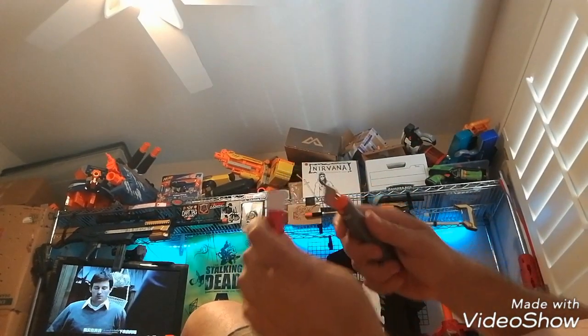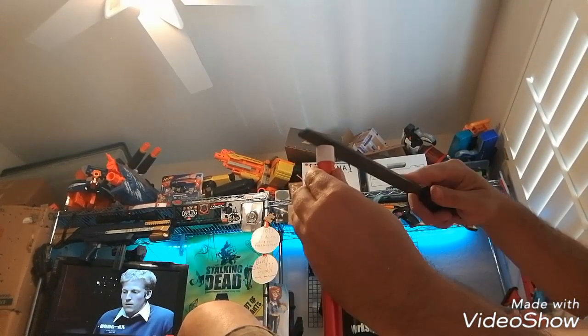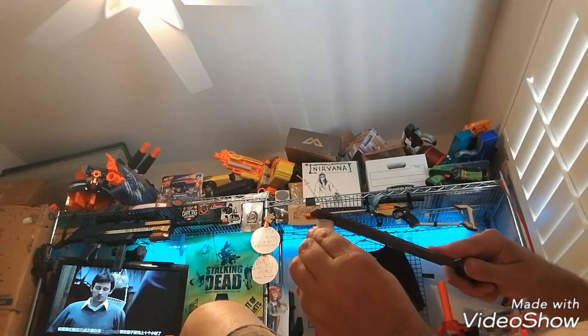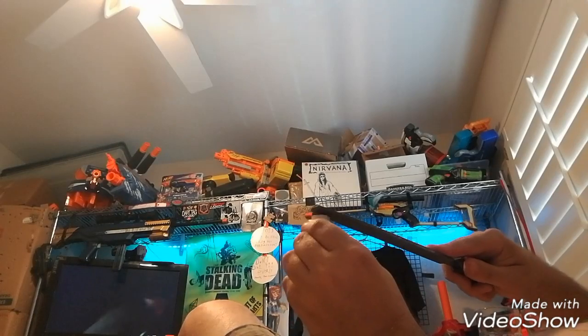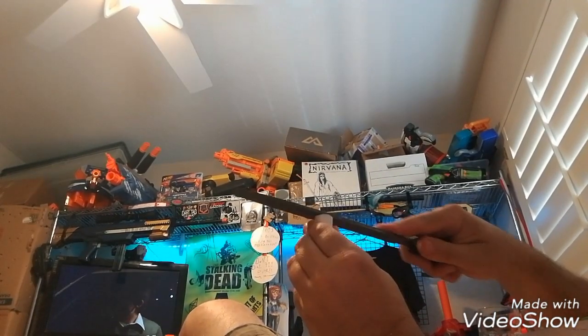Okay, so now I've got it. I filed this down. I'll give it a few more for good measure. What I got is this nice concentric flat level surface. We call this a barrel leveling. We keep the duct tape on there so that if we accidentally hit the sides, we don't mark the anodized aluminum.